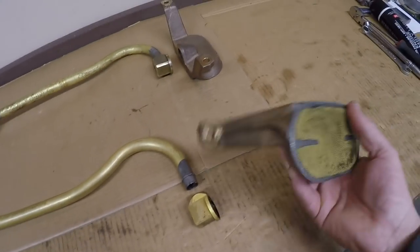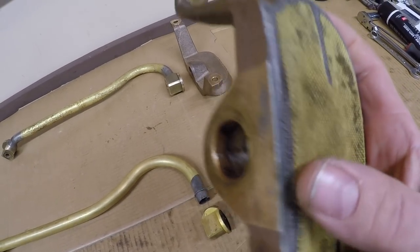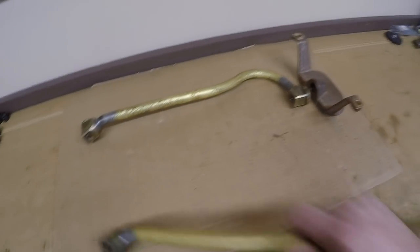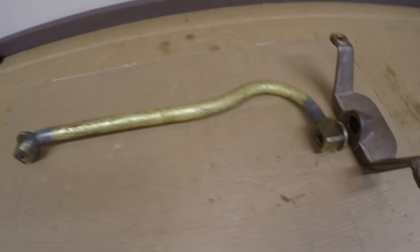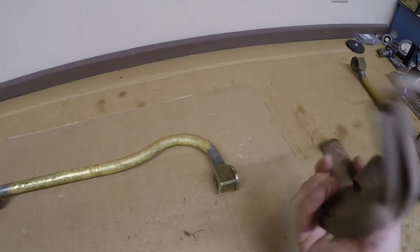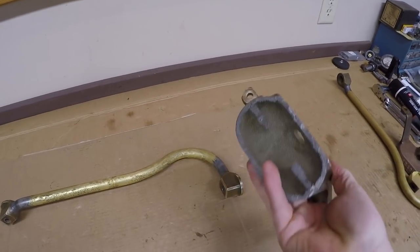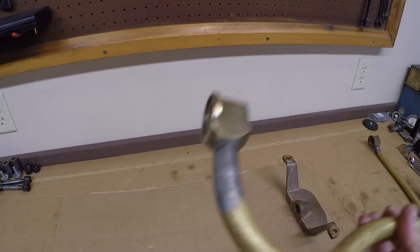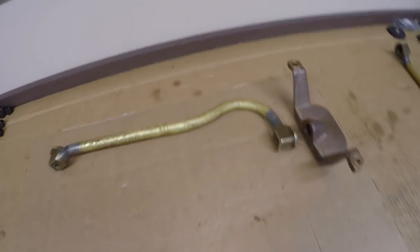I am going to set the damaged pieces aside — I'm certainly not going to throw them away. That would be fairly easy to repair and put back into service one day. I just need to repair where that mesh got pulled out of the solder joint and get that fitting soldered back onto the end of the pickup tube. The front suction bell from 2115 polished up fairly well, it's got a good mesh screen on it, and checking the pickup tube over — no cracks on either of the soldered joints, no leaks, and the gasket surfaces look pretty good. That's the setup I'm going with.